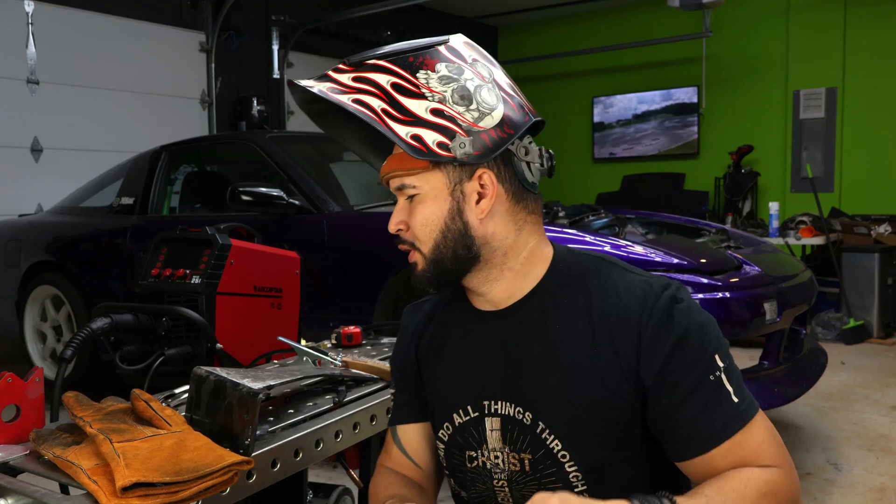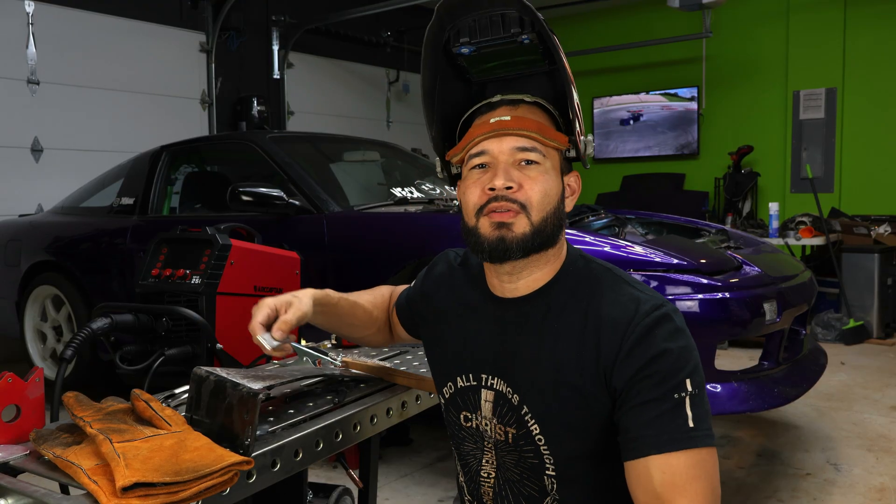Here is a quarter of an inch plate. We're going to start with this — just doing MIG welding with a 75-25 mix of argon and CO2. I just want to show you the quality of the welds from this machine.